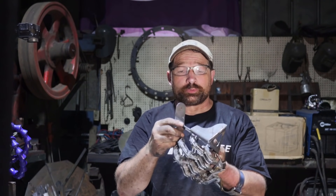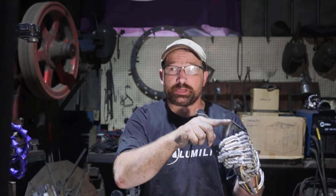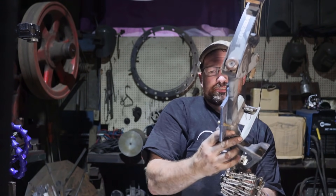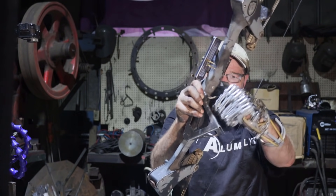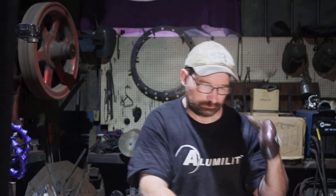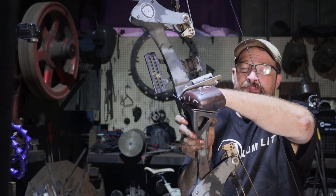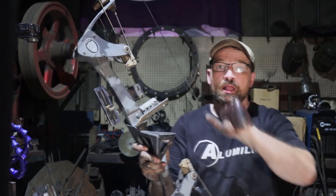That's where we're probably going to end this video today. Bracket looks pretty good. I'll probably end up having to put a little piece of flat bar strip right here just to go ahead and stiffen it to keep it from bending when I'm holding onto it. But as you can see, it looks like it's going to mount up pretty good. And then my hand will just go right there. Let me put a socket on real quick to see what it really looks like. We'll close that gap up when I go and weld it together. We'll pick it up on the next video. Thanks for watching.